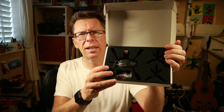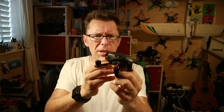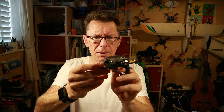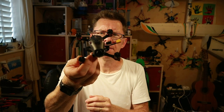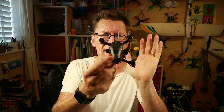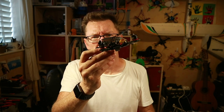It is well packaged and we have here the little Babyhawk itself. What's quite different about this one is this little plastic body shell that comes over and protects it quite nicely. This is the FrSky edition and we're looking at 1106 motors. We've got the Foxeer micro arrow camera, so a micro CCD. We've got an F3 omnibus style board and ESCs that run BLHeli-S, just 12 amps, and presumably they can run DSHOT 600 - I'll be checking that.